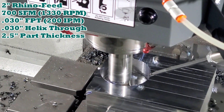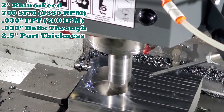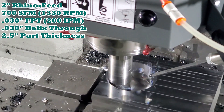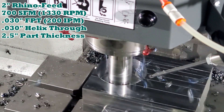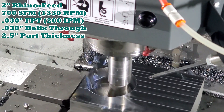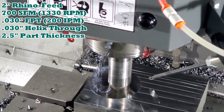As we get deeper into the hole, you can see how critical it is to have good air blasts evacuating those chips. Re-cutting chips is a problem for your cutting edge, but you also heat up your part more by the heat of those chips remaining in that hole. So it's really important to have strong air blasts getting the chips up and out of there right away.